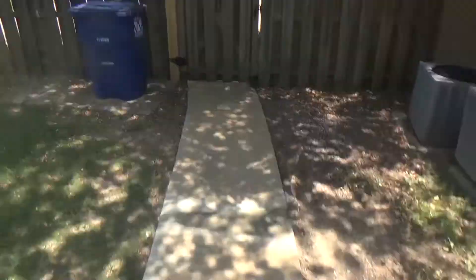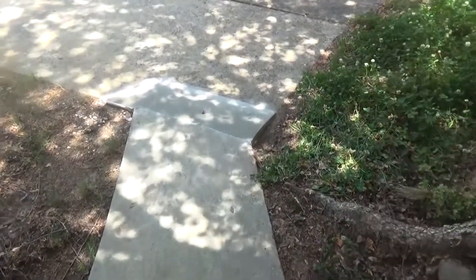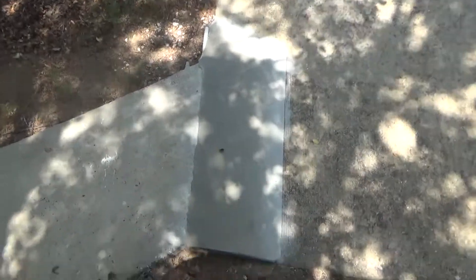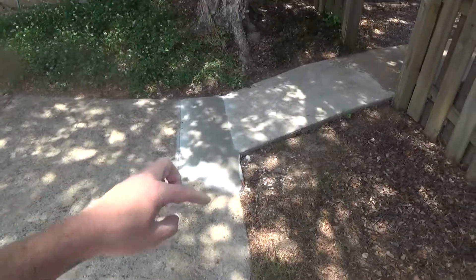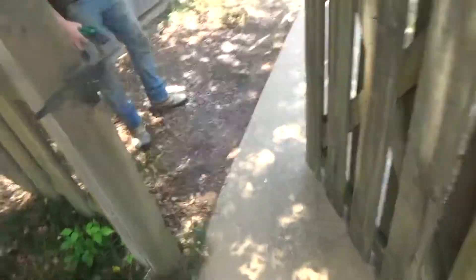When I say a bad area and I say I'm floating it out, what I mean is it has dropped. You can see this area has dropped — we came from there and came further out through here, so from here to here is about 12 inches that we floated out. We brought it down to make it work. Before, you would hit your toe and trip; now you can't do that. Same way right here — this was a real bad spot. We came out about 17 inches, taped it, made a straight line, made it a lot smoother. Before it was about a two-inch gap poking up, so you'd trip especially at nighttime. Now you'll just walk right up it.